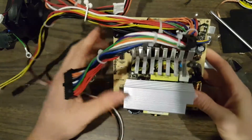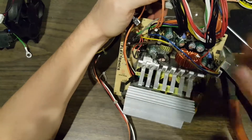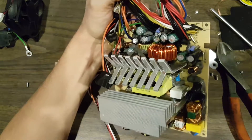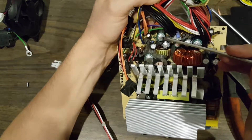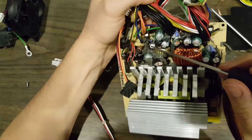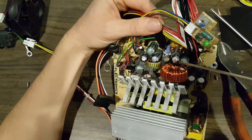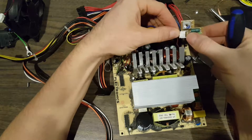So what's worth saving? We really don't need the wiring — that's just in our way at this point. Here's probably the problem with this power supply. You can see that capacitor at the top is bulging and some of the electrolyte is leaking out. This one's bulging as well, so those are probably all gone out of spec. Those are all bulging capacitors and would have to be replaced to repair the supply. Those capacitors are probably way out of their original values and that's causing the supply to fail its POST test or fail to power up. That's most likely why this power supply is not registering good when we press the test button.